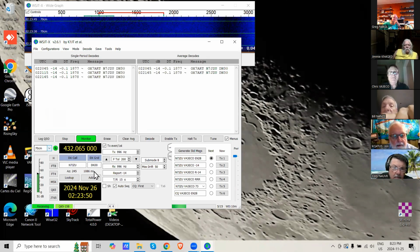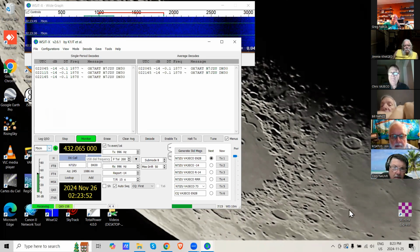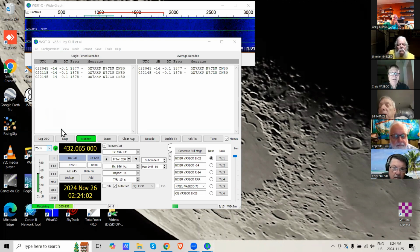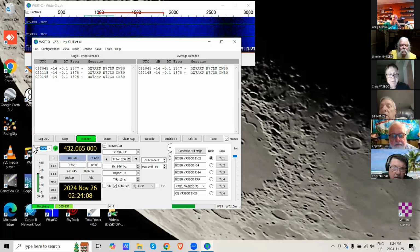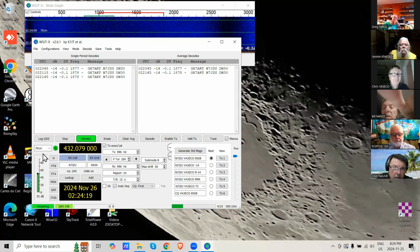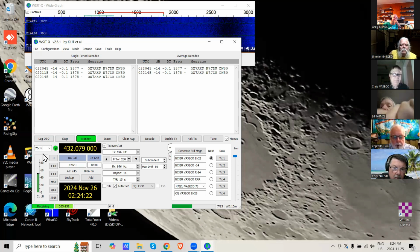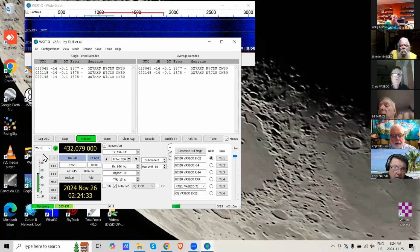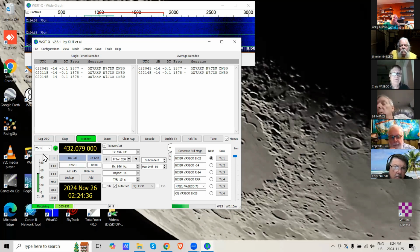Now, if we went back to that fellow that we were listening to, he was on, what was it, 079 or something like that? To enter a frequency directly, 432.079, you just type it in there, hit enter, and there it goes. Oh, there it is. So the same thing goes with FT8, although with FT8 you don't often do that because everyone's at the same frequency, 14.074. Why would you move? But on Earth, Moon, Earth, people could be at 065, 068, 079, 071, and if you're listening for a particular person, you want to go to his frequency.